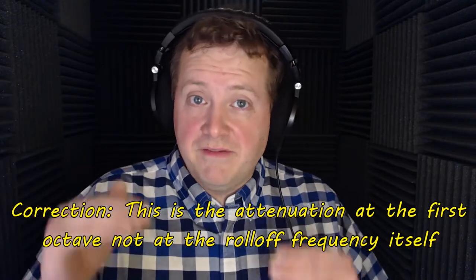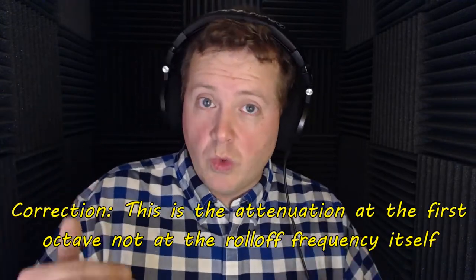Let's start at the beginning. Roll off, high pass, low cut — these are all synonyms for the same thing: an electronic filter placed at a certain frequency where the microphone will have already attenuated down three decibels. Microphones are designed to attenuate in six decibel increments per octave — that's a first order roll off. Twelve decibels per octave is second order, 18 is third order, and 24 is fourth order. Remember, at the roll off frequency the sound is already attenuated three decibels, so a first order roll off is actually attenuating at nine decibels per octave at that frequency; second order at 15, third order at 21, and fourth order at 27.